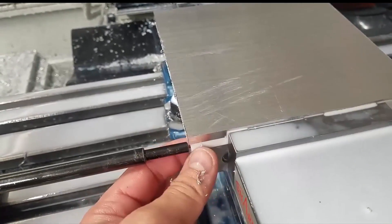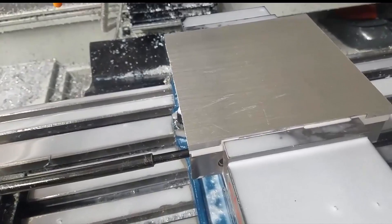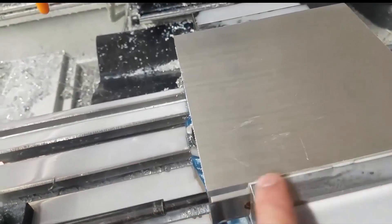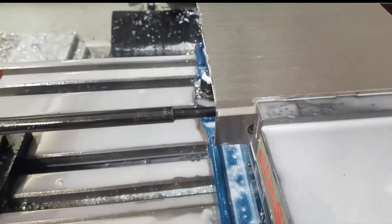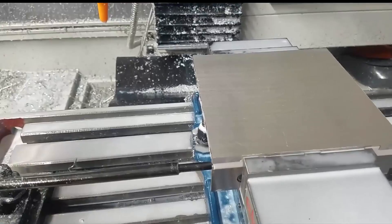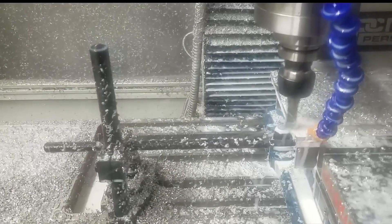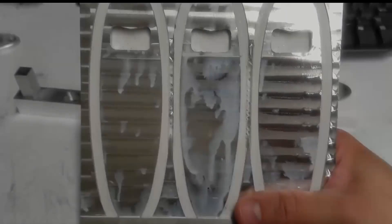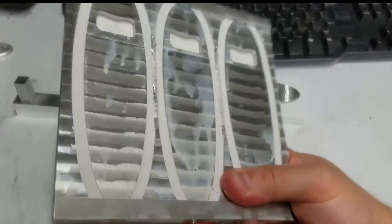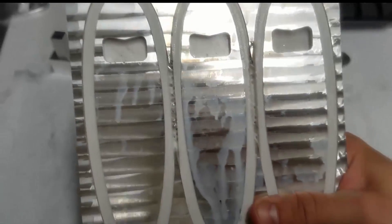Here we are in OP2. We've got our 3D printed jig holding the bottom, so when we face off the top it's going to hold all three of the surfboards underneath and keep them from moving. Note that you have enough clearance for the face operation so it doesn't hit anything — my sanity check. I've re-zeroed Z, but X and Y remain the same. And there you have it — we have our surfboards cut. You can see the white jig underneath holding everything in place. Now all I've got to do is take a Dremel to those little sections and my surfboards will be cut free.